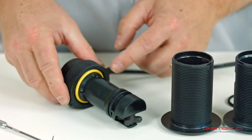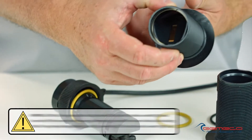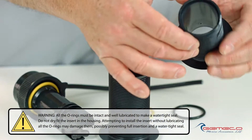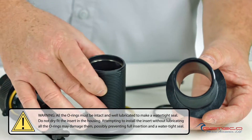The first thing I'll mention is you'll notice there's a yellow O-ring up underneath the cap here. That is designed for the valve housing that came with your Tri-Ducer Multi-Sensor. If you have a through-hull fitting that did not include that valve, you can still use this sensor in there and then change the fitting out when it's convenient the next time you haul the boat.